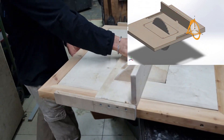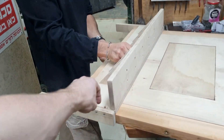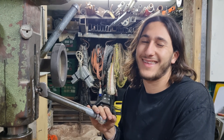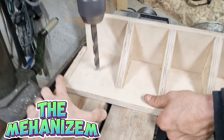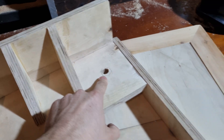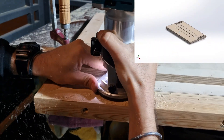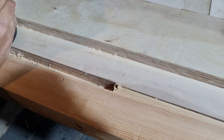The saw is going to go over here and this is the fence — looking amazing! Up next is the mechanism that locks the whole thing in place. Now we're going to make the hole for the mechanism. We're going to drill through and make a rail. We traced it out with a pencil through the hole, and now we're going to take it out with the router. When cutting a deep groove with the router, you need to make a couple of passes — otherwise it won't work.